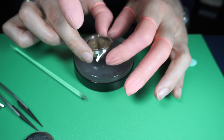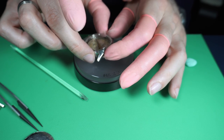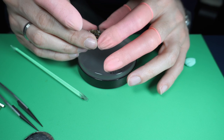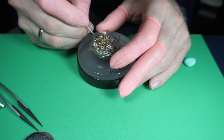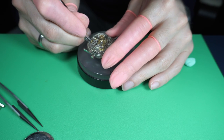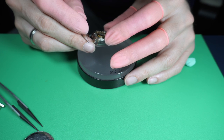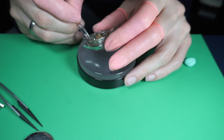I've changed the crystal — put in a new one. It's not expensive and very easy to change, and it always makes a watch look much cleaner with no scratches. I prefer to change the crystal rather than use Polywatch. Now I'm gently putting the movement back into the case using a plastic stick until it seats correctly — it was quite tight to fit.